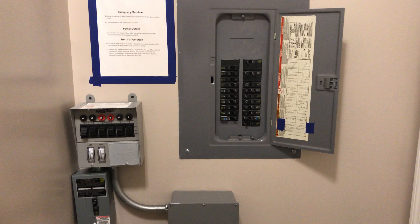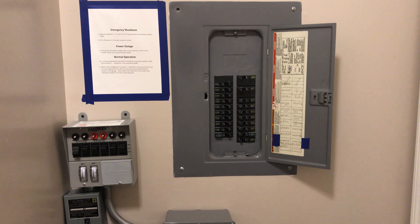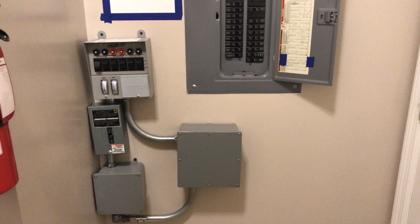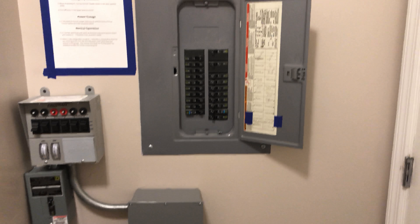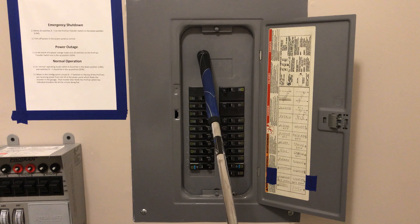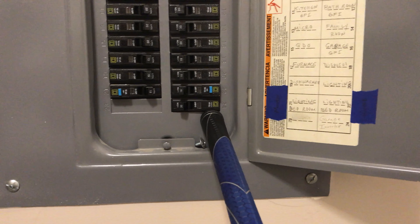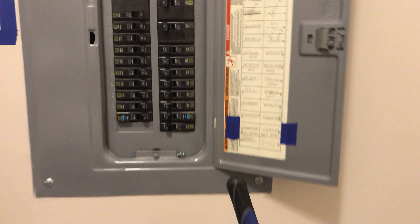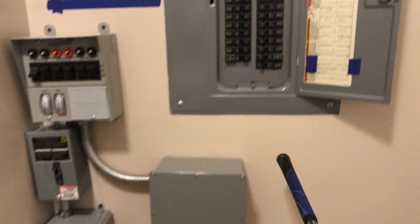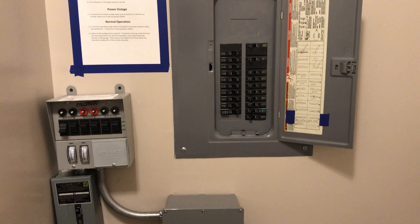I'll give a high-level overview of how the system works and how the power flows, because there have been a lot of questions about that. There are two feeds — A and B side — coming in to feed these circuits. What I've done is add a 30-amp breaker at the bottom, labeled 'garage inverter' because my inverter is in the garage. Power comes in from the utility, feeds this breaker, runs through this junction box, up through this tube along the wall, and out to the garage where it feeds utility power into my inverter.